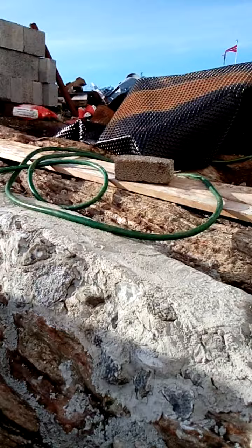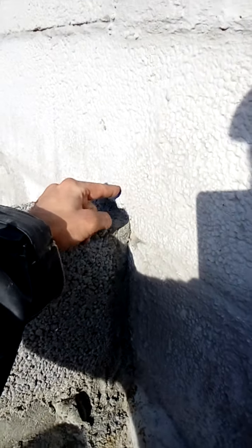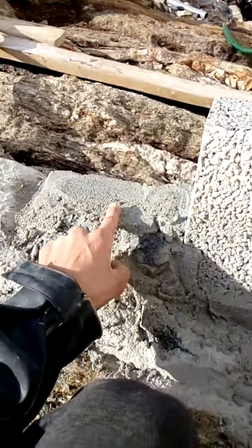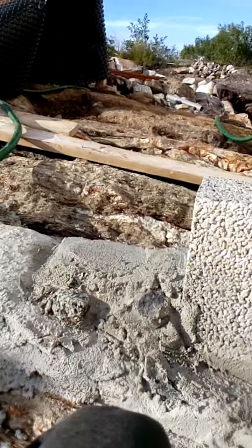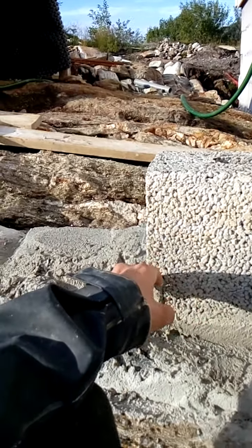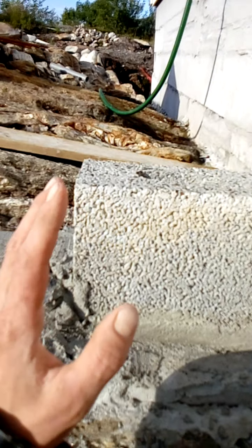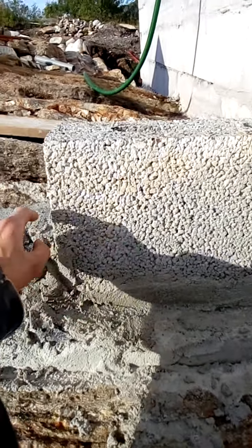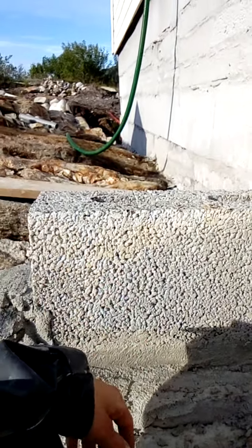On every second course here I'll drill into the wall, lay a rebar, and put a brick on top. I use concrete instead of mortar — concrete is cheaper and stronger, but it's not ideal for softer bricks. The rule of thumb with bricklaying is that the binder — the mortar — should be softer than the brick itself to allow flex, because even rocks and structures get tugged by wind. If your binder is harder than the brick, you're more likely to see cracks emerging on the brick.